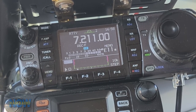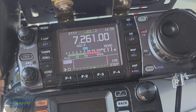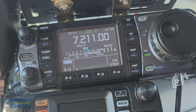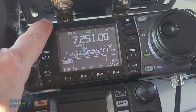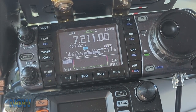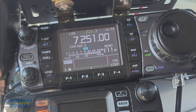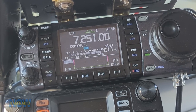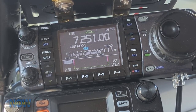Back on 40 meters with no antenna connected, just the dummy load. We'll click the mic to step up the band. That dummy load is good — SWR is right down at 1:1 and the radio is not shutting off. So we can say the problem is only occurring when the antenna is connected — it's not a problem inside the radio. Kind of expected that, but you have to get here to test. We've also determined it's not really an SWR issue with a high standing wave being presented to the radio.